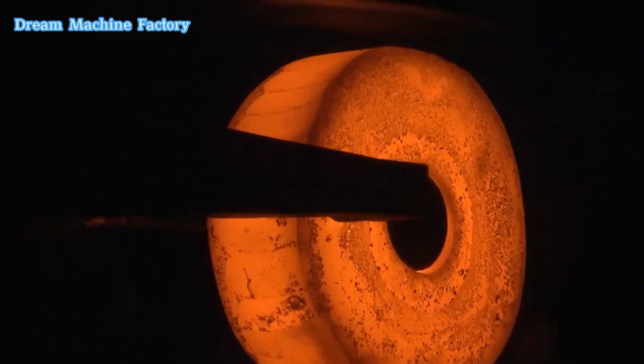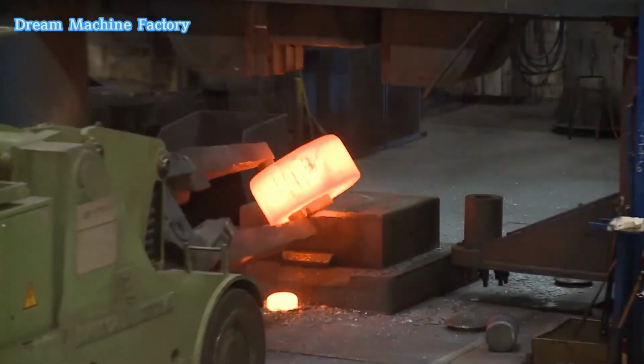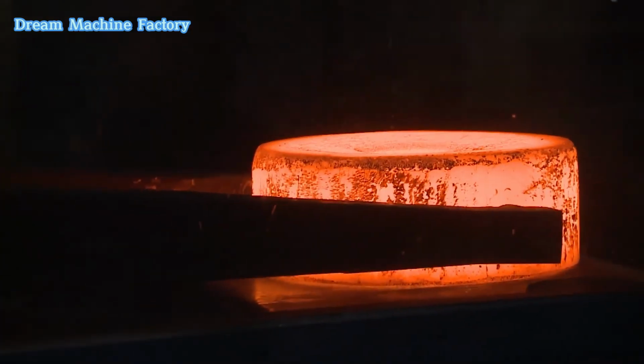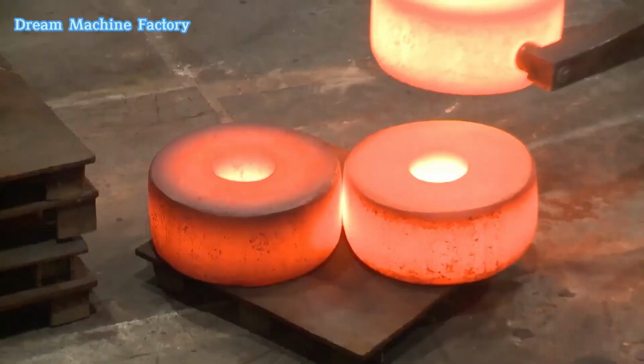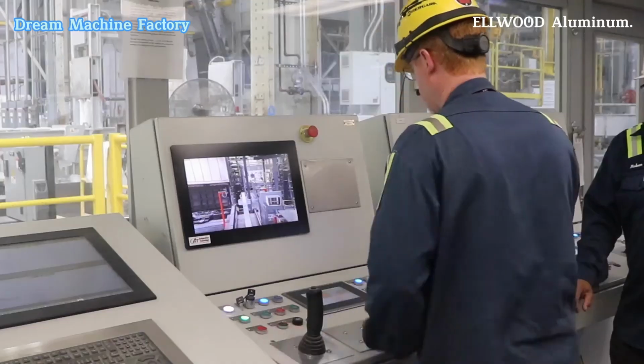For larger forgings, electro-hydraulic handling equipment is employed to manipulate pieces under steam hammers, weighing up to 6,000 kilos. The open die forging process allows Dirostahl to produce highly customizable forgings in both major orders and serial production.